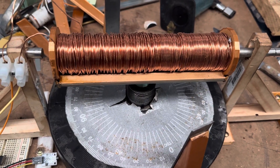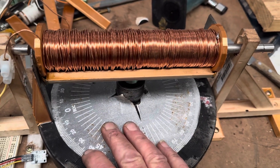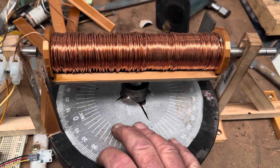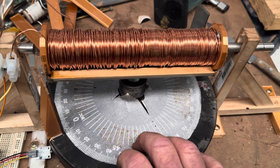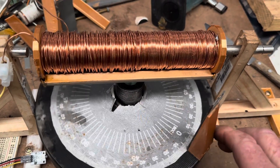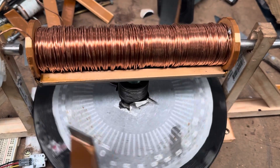At the moment it's on about 12 volts, using about 90 milliamps. The coil itself has got about a kilo of wire on there. The resistance of that is about three and a half ohms, so ideally I'd probably want to put another 200 grams on there to get it up to about four ohms — that's probably where I'd like it. That was just the first run, so a bit of work to do yet.